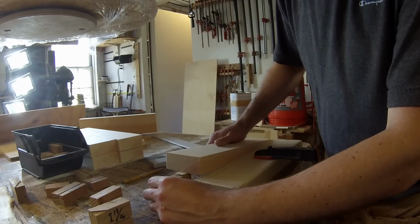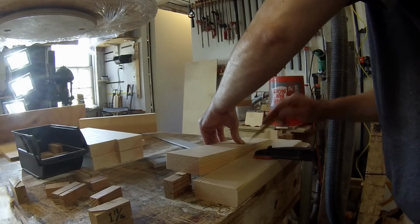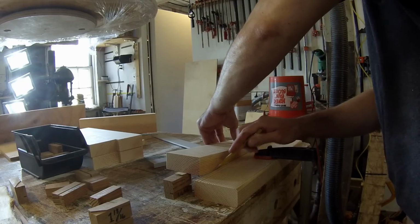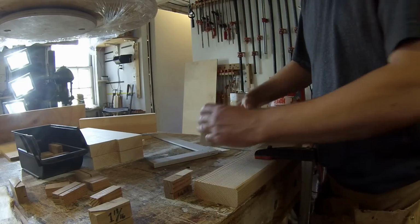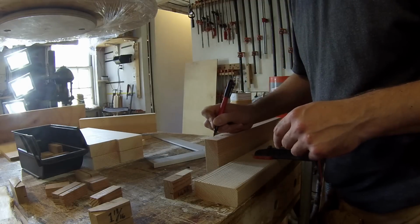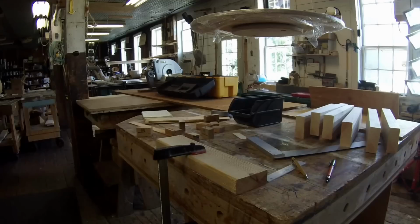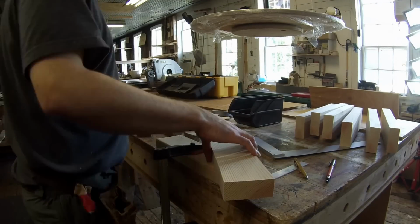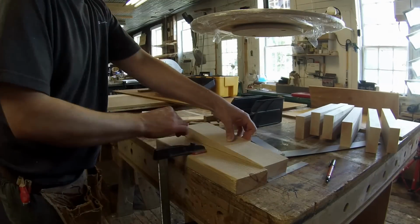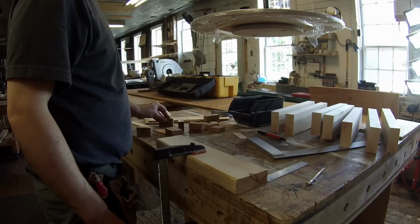Okay, so here I have a straight edge jig marking thing for making those angled marks on the Douglas fir pieces I just cut out. And so each one of these pieces is measured and numbered. And the blocks of wood are referencing the height that each one is sitting at on the floor. And I have a whole bunch of these blocks in 1/16 increments.